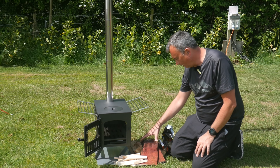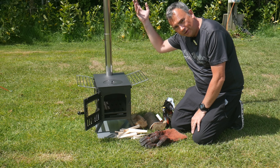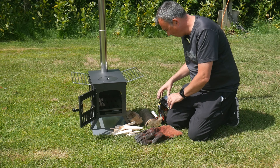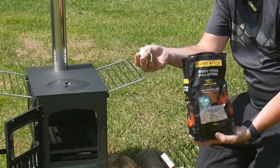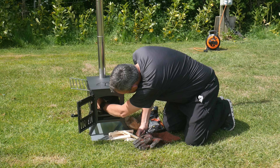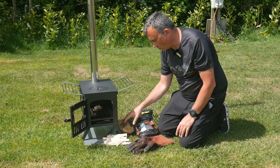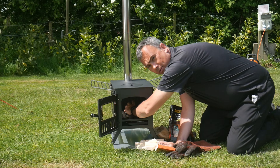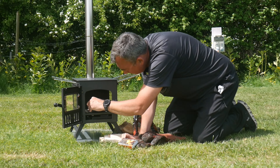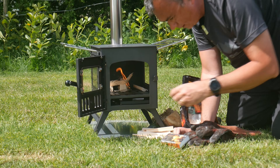Don't just cram a load of wood in there and set it alight. The best way is to start the stove up gradually. Once we start getting some heat in here, the hot air is going to go up the flue and draw fresh cold air in, so it will continually draw through and not smoke elsewhere. We find these little wax-covered fire lighters ideal - you can get them in Home Bargains quite cheaply. Start with those and then add small bits of kindling. Make sure you're using dry, seasoned wood. Put the fire lighter right towards the back underneath the flue - that's where you want to start getting the heat going. Then just get some sticks over the top and start getting those alight.